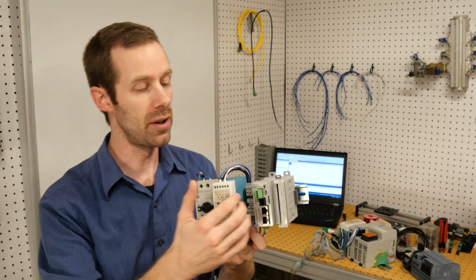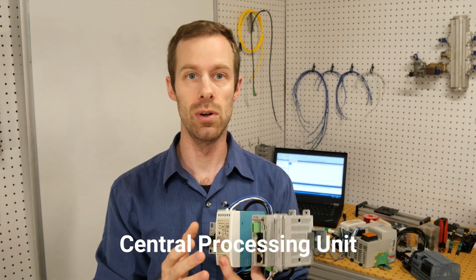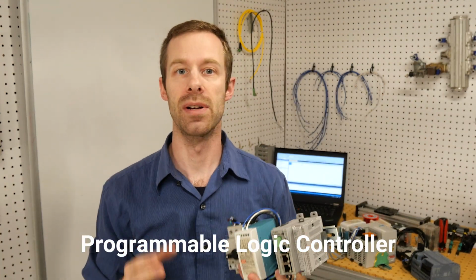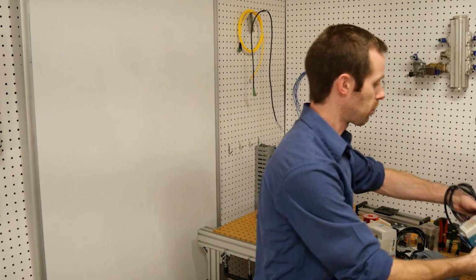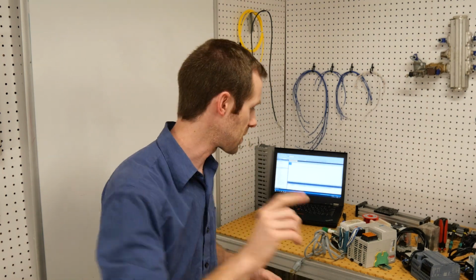So this first part is the CPU, the central processing unit that is critical for the whole programmable part of the PLC. Now another, probably just as important part is the I/O, or the input-output modules. We say modules, and sometimes we use the term cards because in computers cards can mean some pluggable and removable pieces, but they're not actually always removable. Let's take a look here.